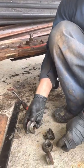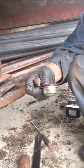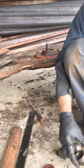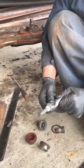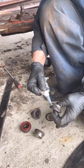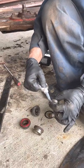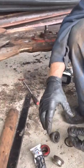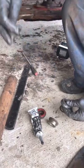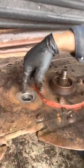Take the thin shim and put it on the top housing — that's going to give you a little bit more grip, and it's going to push up on the underneath side. I'm also putting a little gasket silicone on there just to add a little extra sealing capacity. About every other one of these idler spindles was leaking, so that's why we're doing this.